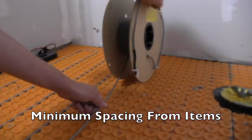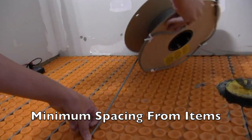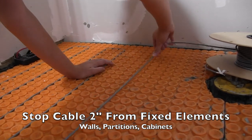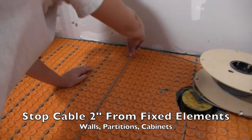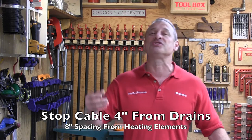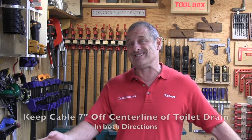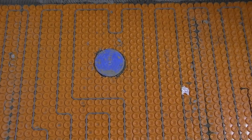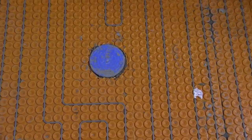When planning the system, here are a couple of tips. You're going to need a dedicated ground fault circuit interrupter — the GFCI. The Ditra Heat thermostats have built-in GFCI protection. You want to keep a minimum spacing when running your cable: two inches from fixed elements such as edges of walls, partitions, and cabinets; four inches away from any drains; and eight inches from heating sources such as baseboard heaters, fireplaces, and air conditioning ducts. Also, stay seven inches away from the center line of the toilet in both directions.